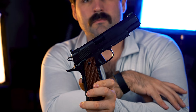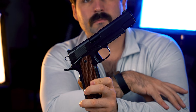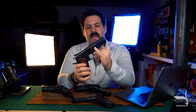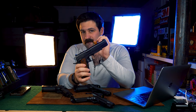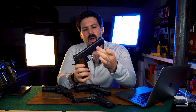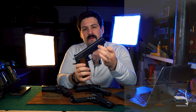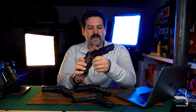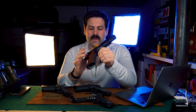but matte hard chrome and matte DLC are also available. You could do a two-tone if you wanted. Of course the rail does have this sort of cutback, and on the Quantico single stack full-size guns we can cut this 90 degrees and then ball cut the gun for you if you'd like, but you need to talk to me about that before we do that — send me a message or put it in your order notes.